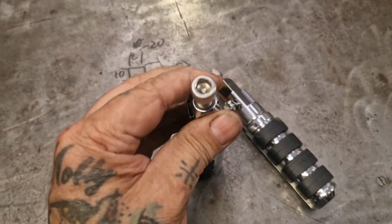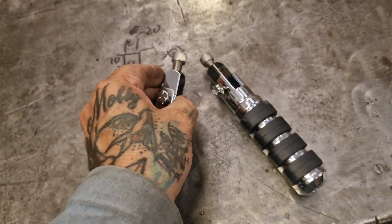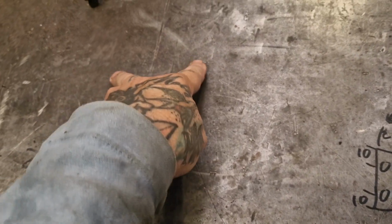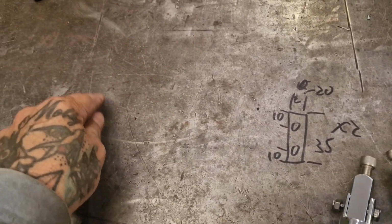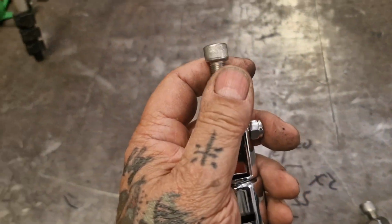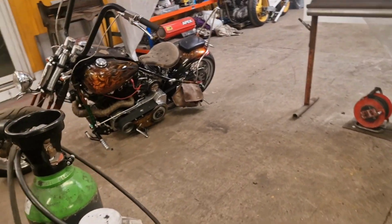Alright, so we're going to have a recessed hole for that on the bottom one. So we're going to have three things basically. We're going to have a round and then two more, and they're going to join up, and they're going to be countersunk for M8 or M10, and this bottom one is going to be countersunk from behind. So I need to make 6 countersunk jobbies, and 2 bits of tube each side, 4 bits of tube, and 2 brackets to weld onto the frame each side, 4 brackets.